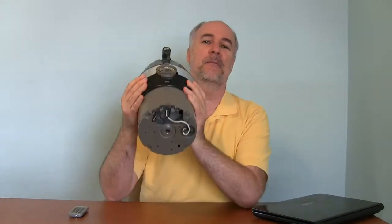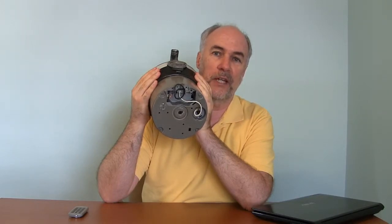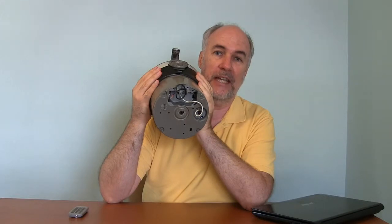It's a very heavy thing. To install it, if you're down on your back trying to lift this thing up over your head, you can see why it's a chore. Not particularly complicated, but you do have to get all the seals right or it'll leak at the bottom of your sink — you've got to get the seals right or water will go everywhere. At the bottom we've got a couple of wires, positive and negative. You have to have the wiring underneath your sink for the garbage disposal, and it's just a matter of twisting these into the appropriate little plastic pieces to hold it. Once you've done that, it's hooked up to the switch on the wall, which controls the power to it.